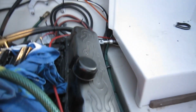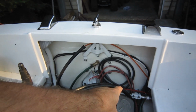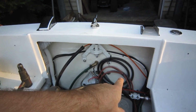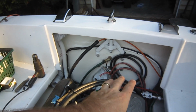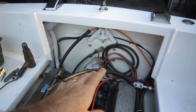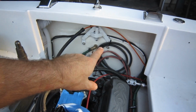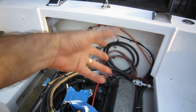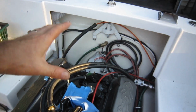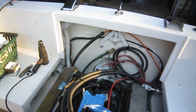But it's its own animal, because it's going to have to start from right here, and I'm going to have to know where everything goes from that point. Once I break that line, I'm going to have to start using shrink wrap and wire loom. If I'm using those, then I have to be like 5 steps ahead at all times, because it'll branch off, and if you don't have your stuff already up there ready to go, you can't cut the sleeve. It's got to be on before everything branches off, or you're not getting it on. So that's something we'll do entirely different.